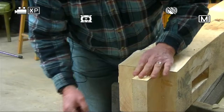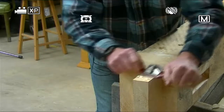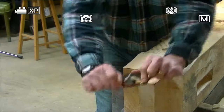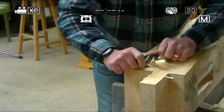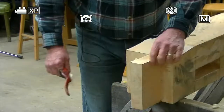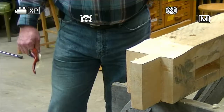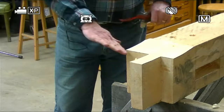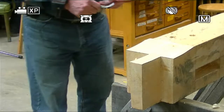You can see I've pretty much dealt with this line out here, just a little bit over here to go. Basically what I'm doing is creating my tenon that is ultimately going into a mortise. I'm going to stop there because I'm not using that joint. But that's kind of how that's laid out. This is a post, so when it's standing up, you're going to see that very natural curve up at the top as it sits into the tie beam or the plate that sits on top.